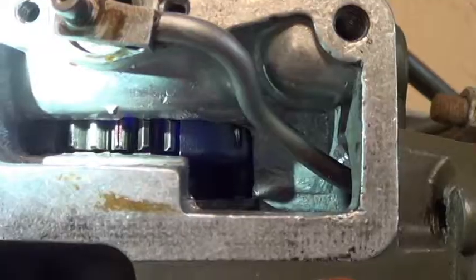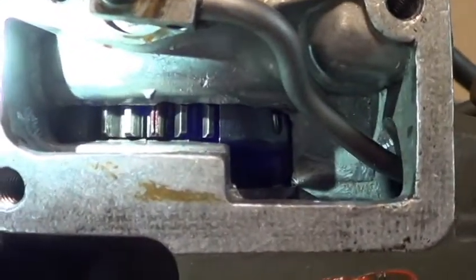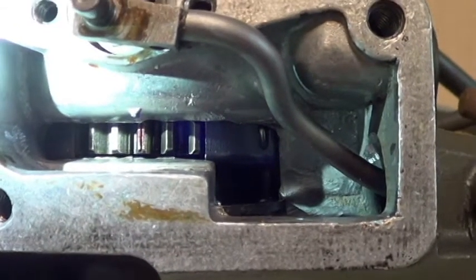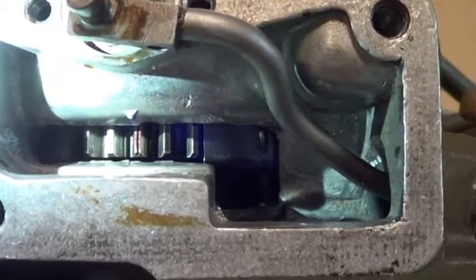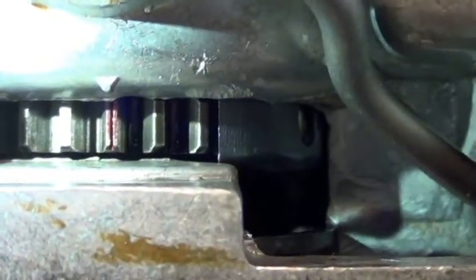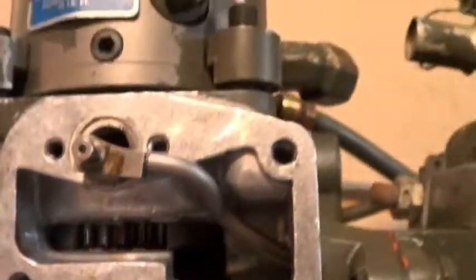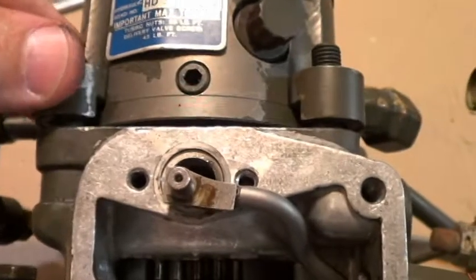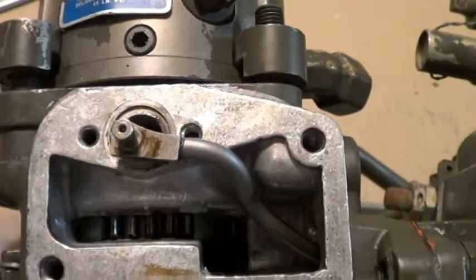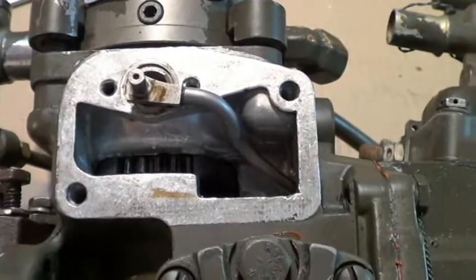Before you remove the hydraulic head, underneath here there's actually a timing notch for the hydraulic head, and it does not correspond with the timing notch in the window. They're close but they don't line exactly up. If you can see that one tooth there, it's got a little bit of a notch on it — it's pointed like an arrow. That has to be lined up before you take the hydraulic head out. I've taken the retaining bolts for the hydraulic head off and got these retaining clips loosen up. Once that's lined up, this whole hydraulic head's going to slip up and out.